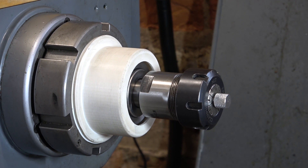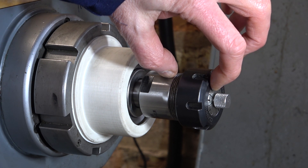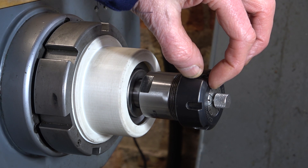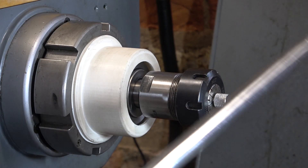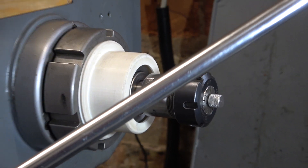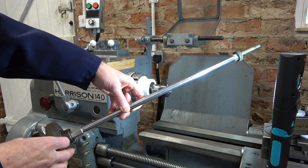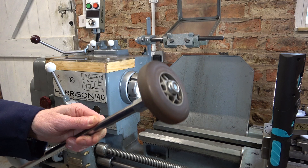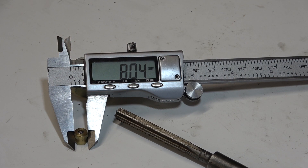I'm going to hold the screws in my ER32 collet chuck. One thing about ER32 collets is that they need quite a length of work to grip properly — they won't grip well on a short piece, whereas 5C collets would be okay. I'm also going to use this homemade drawbar, which is just a piece of 12 millimetre threaded bar with a sleeve and a scooter wheel on the end. The oilers are 8 millimetre diameter by 8 millimetre long, so I'm going to use a 5/16 reamer, which should give me about a thou interference fit.